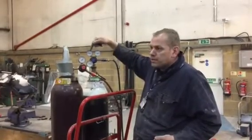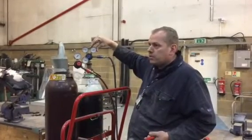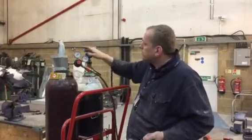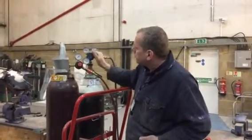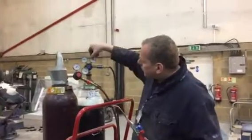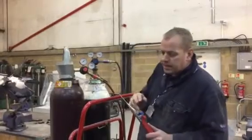Turn the bottle on and you get a bottle pressure here. Where the pipe comes out is the pipe pressure. We want to set the pressure at 0.5. So bring it in to 0.5 — screw it in and watch the gauge come up. Turn the oxygen on and we want to reset it to get a working pressure at 0.5. So that's it there.